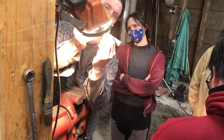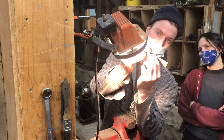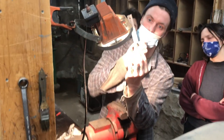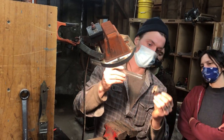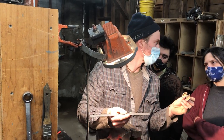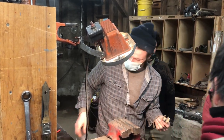Somebody has sharpened it, but just on this edge. Does that make sense? Yeah. So if this isn't perfectly flat, sharpening just this is something that you'll run into sometimes. People will have done that. And it's a little harder to tell, which is part of the reason why I Sharpie the faces. It's because you can see where you're removing material. You don't have to remove much, but it needs to be from the right places.